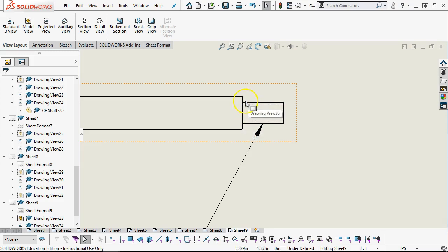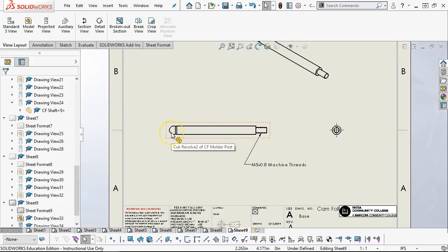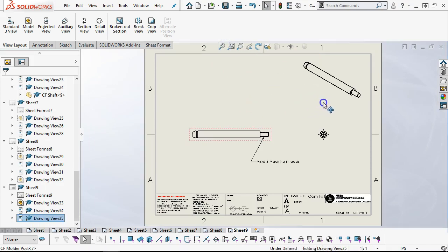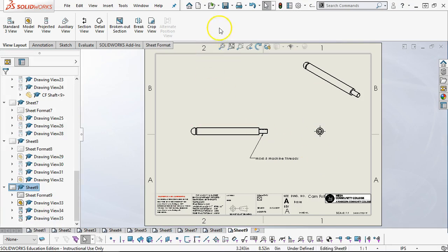So that means we probably need a countersink on the mating part, so that it can come up and contact the face. Again, there's nothing that says that this can't unthread itself, and nothing that is keeping this from becoming a stress riser if we induce a lot of side load. Again, I added the spherical radius that was not in the original specification, kind of as a future project or addition to this project. So we'll call that out, and we'll see what we can do with it for runout.